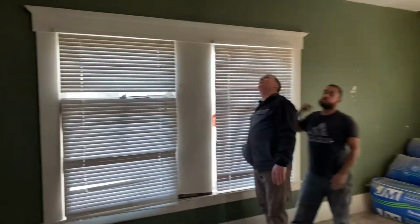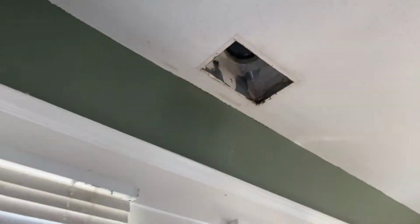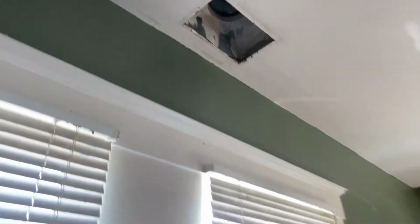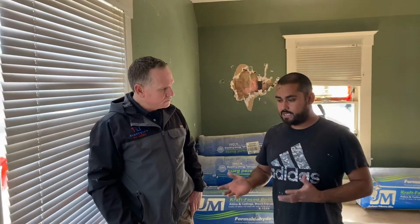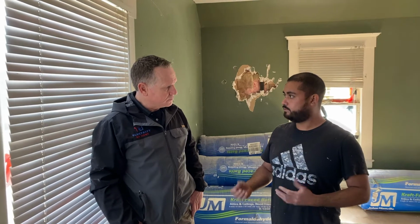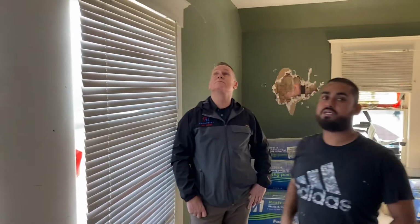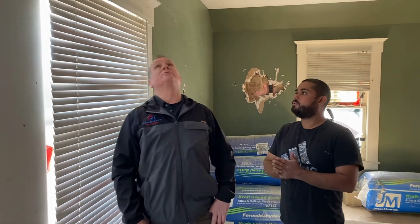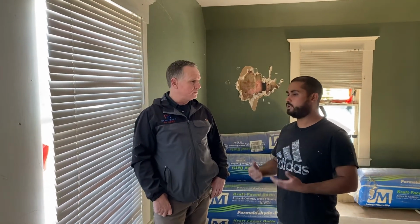Oh, wow. So, like I'm saying, what people used to do, they used to use duct tape or flex tape and go around the elbow. Well, that's going to save your company a little bit of money because you're not going to be wasting a lot of tape. And mastic is fairly cheap. So you put some of that inside the elbow, and when that dries out, it's never going to break. It's going to last forever. It's like it's got an exclusive seal. Correct. So you don't put any of the flex tape outside, and you for sure are going to get zero leaks.